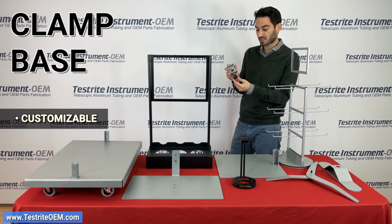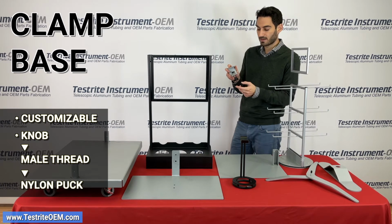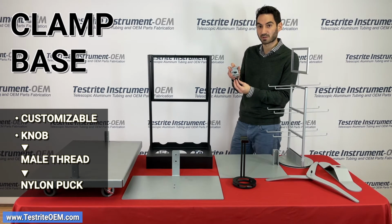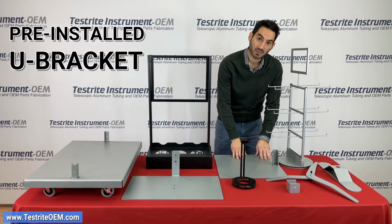Typically the clamp consists of a knob with a male thread and a nylon puck. This way, when you tighten up against your counter, you're not going to mark it up. This nylon helps spread the forces around so that you're not going to dig in and hurt your nice, beautiful counters. The next example here is a U-bracket pre-installed to the base.